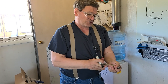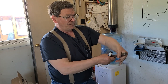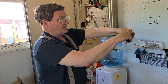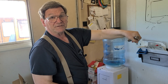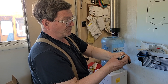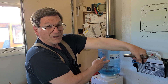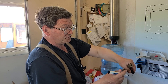The other way a lot of people do this — and usually you get by with it but not always — is they'll just chuck it up right on the end and face it and thread it. You've got it running true because you dial it in, but you're depending on your chuck jaw condition. Even a couple thousandths crooked on this surface can make quite a vibration on these. So instead, if you put a little counterbore in the center, center drill it, sneak it out and give it some distance — if you're off by one thousandth at the chuck, you'll be off almost nothing out two feet away. The center here is true, so you get a face that's true with the centerline of the shafting.